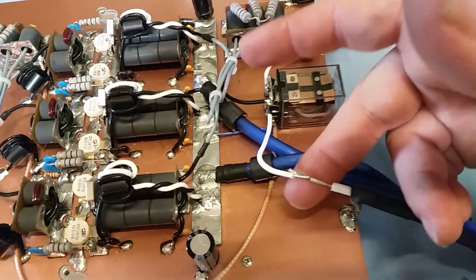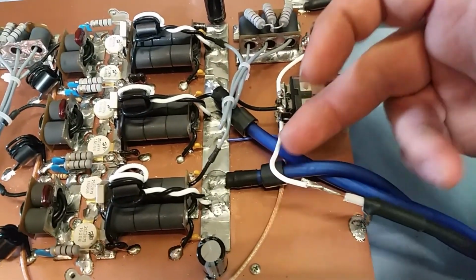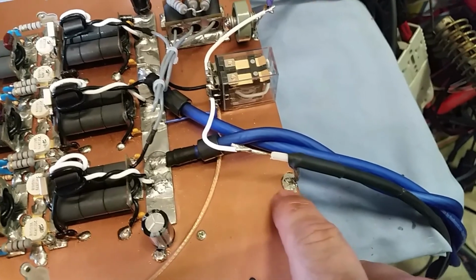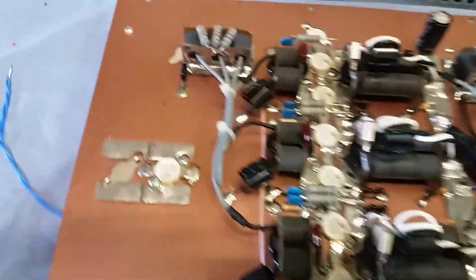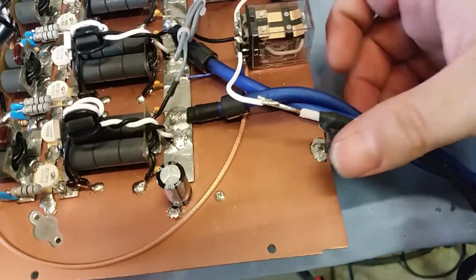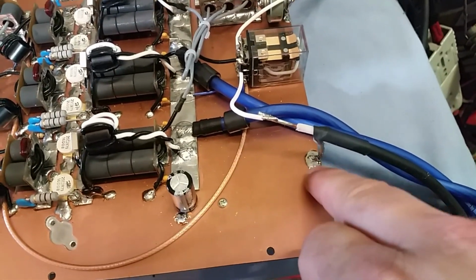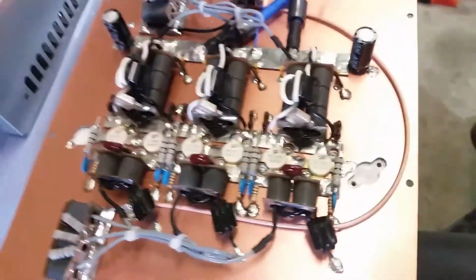But so here's your lines right here, of course, that you'll be putting to. Of course, if you need to unsolder these and put coax to them, you can. I had to go ahead and put solder splats right here for the leader lines. I try not to put any solder, like when I'm tuning or something. I try to only put solder down or use another solder pad so you won't have pieces of solder on the board where there's nothing at and make it look tacky. But I just couldn't get over it. I had to put that on there to solder the leader line. But anyway, you can see what's going on here. So let's get on to the point, man. And real glad the way it turned out.